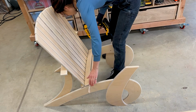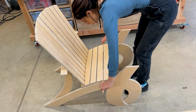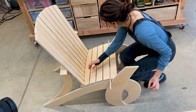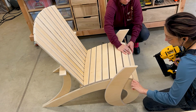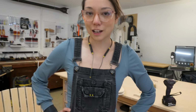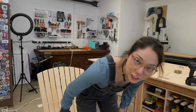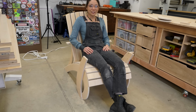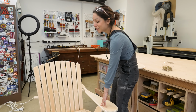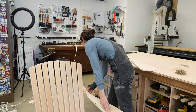And then to space out the bum slats, I found a piece of scrap wood that was exactly a 1/4 inch wide. And so I just used that as a spacer between each slat, and then all of my slats are perfectly evenly spaced. There's no armrests, but it's time for the inaugural sit. Damn, that's pretty good. My backyard parties are gonna be poppin'.